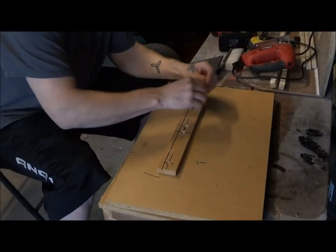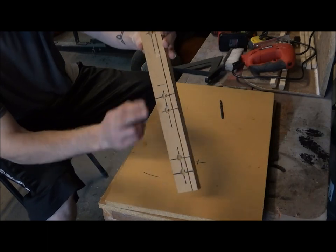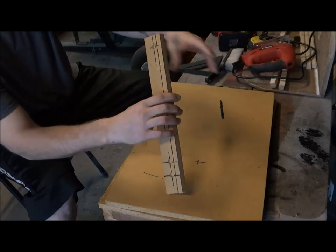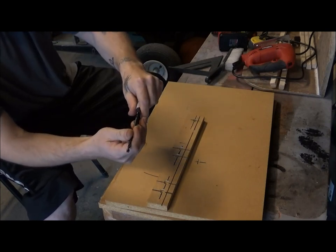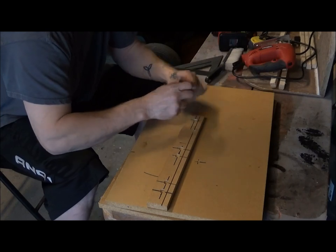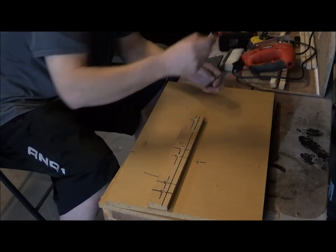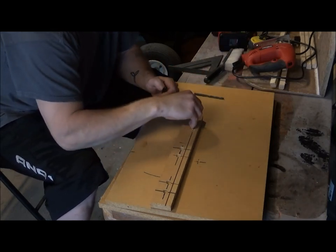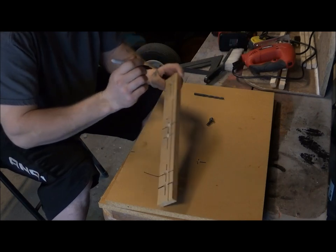As you can see, I already made this little compass, as it were. It's got multiple holes. I actually just made it. What you do is you get your drill bit, and I used a Sharpie, so I used the same size of bit as the tip of my Sharpie. What that'll do is, you go by center and you drill through the center, which some of these aren't perfectly center, but then after you get the hole drilled, you'll want to take your countersink and countersink it in there. And then whenever you put your pin in, it'll stick down out the bottom.